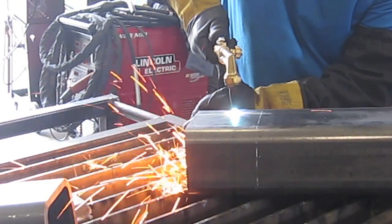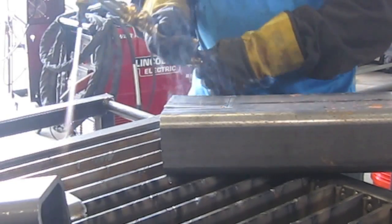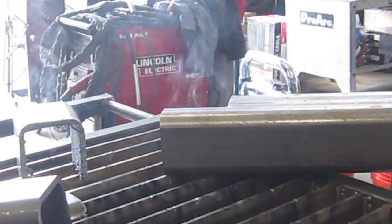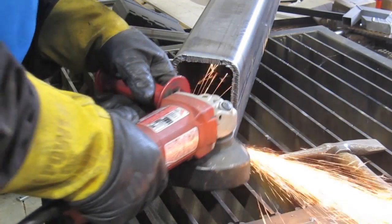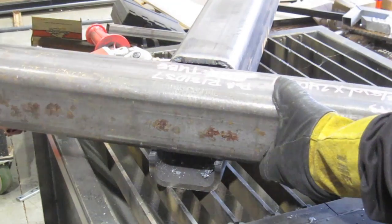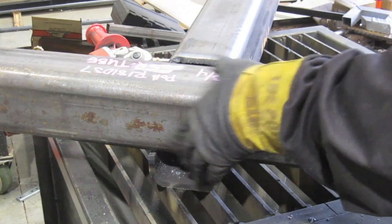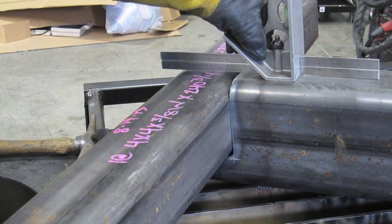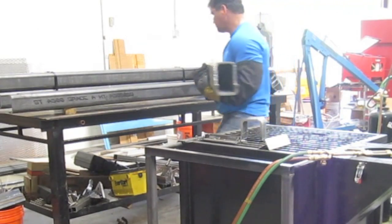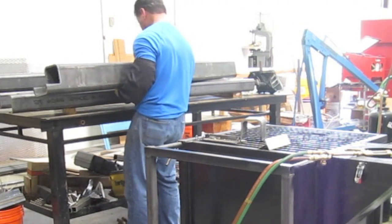You can see how close I've got those cones off of the line. A lot of guys use a lot more standoff than that — I've seen experts at welding shows hold it like an inch away and make a beautiful cut, but that's under pristine conditions with a brand new tip. This tip could use a little cleaning, so I generally tend to hold them fairly close. It needs a little grinding — not a perfect cut — but just a little bit of grinding and it's good to go. I'll do a little fit check with that four inch. We're within maybe 50 thousandths or so, so close enough.